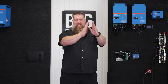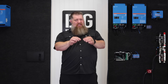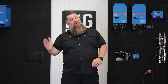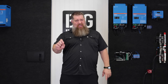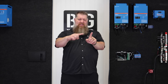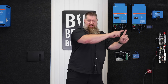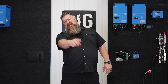If they're going to a bus bar, we want to include the length of the bus bar. If you're doing custom cables, it's not hard to add in the difference. If there are two different posts on the bus bar with an inch difference, the one on the second post needs a cable that's one inch shorter. I want the electricity to hit from both batteries at the same time. Proper length of cables is a priority.